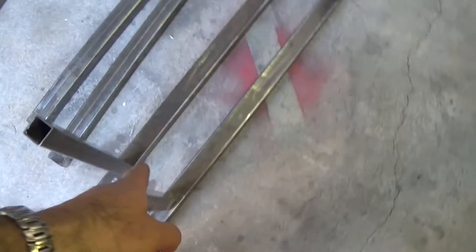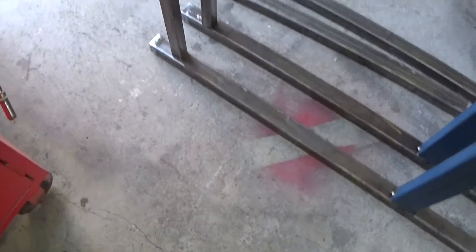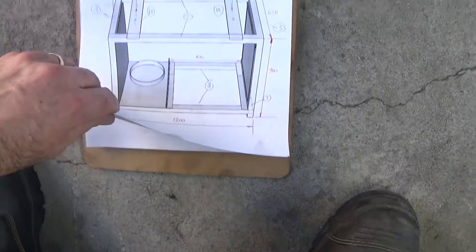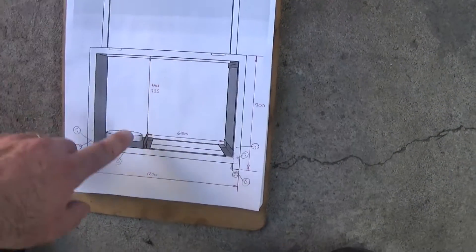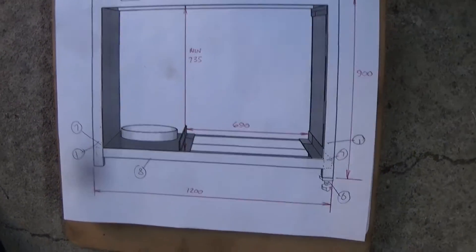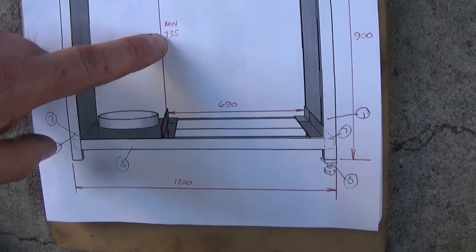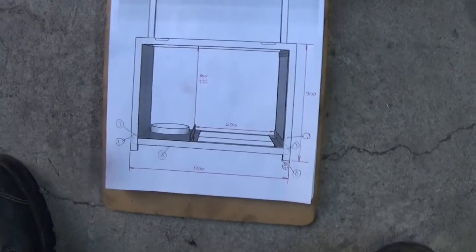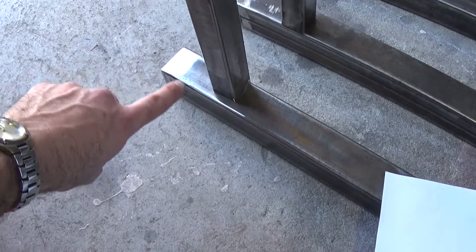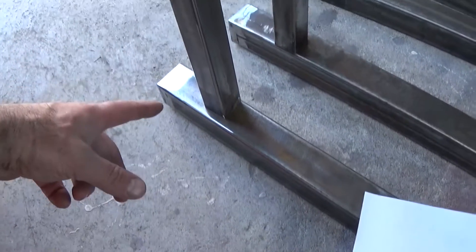I need to set the spacing height based on the cabinet height. The minimum is 735mm, so with the angle being about 5mm thick I need 740mm minimum. I'm going to aim for around 760mm or so — it's not critical. All it means is there'll be a smaller gap under the rail to the floor; too small and I can't sweep under it, so it'll just fill up with junk, but that's what it is.